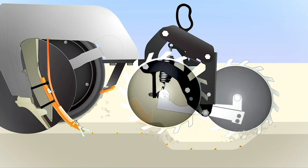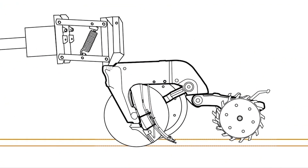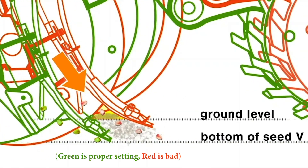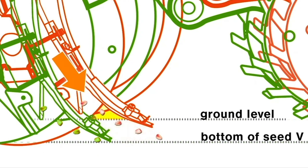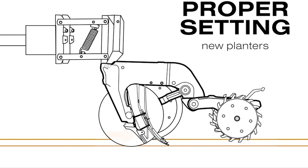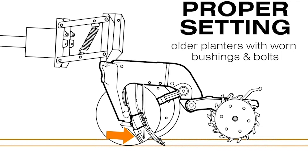When the row unit is tilted too far forward, the seeds are coming out incorrectly. If you have dry, loose soil coming in around the seed you could have germination problems. If the seed tube is set right and the planter unit is running level, all your seeds will be in the bottom of the furrow. When the gauge wheel drops soil, it'll be dropping it on top — the seeds are trapped underneath in moist soil, so you'll have moist soil on three sides of that seed.